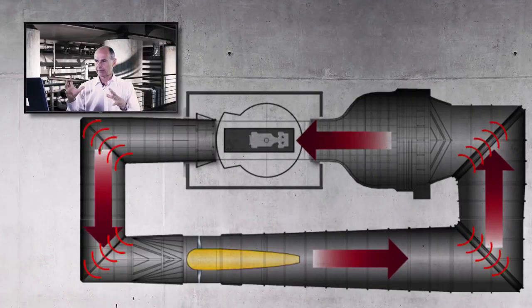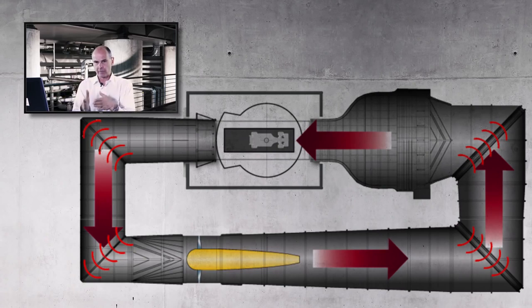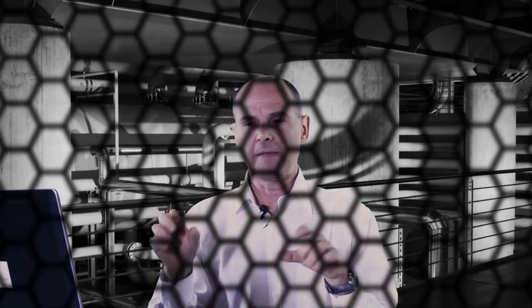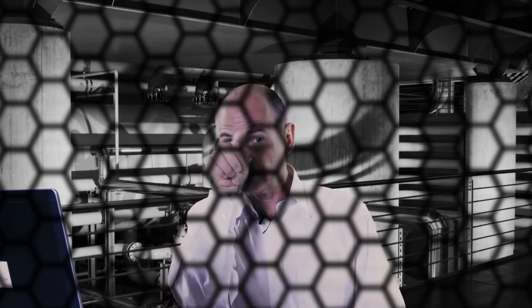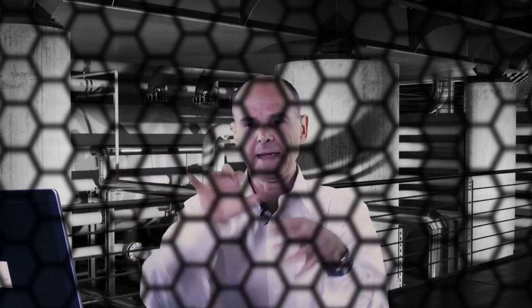When we get round to the last leg before we have the working section, we have what is called a settling chamber, and as the air passes into the settling chamber we expand it reasonably quickly. We then have a blockage caused by, in some wind tunnels, the radiator, but we have a radiator and then separated from that a honeycomb, and the honeycomb is aligned so that you just see the edge of the material in the direction of airflow. But any remaining swirl in the air is almost entirely eliminated by passing through a rather long series of effectively rather long thin tubes, so that the air, if it's swirling approaching the working section, that swirl is eliminated. So that's the purpose of having a honeycomb.